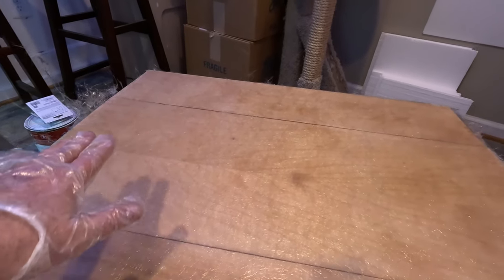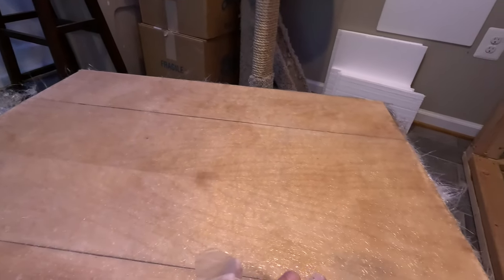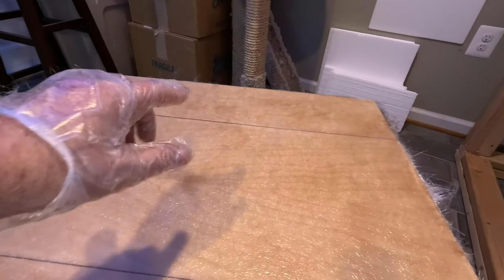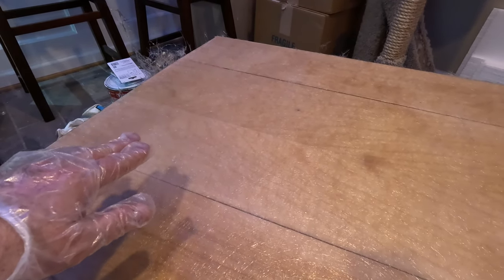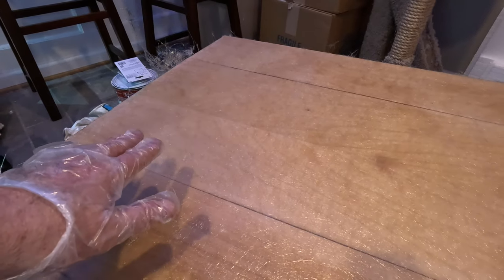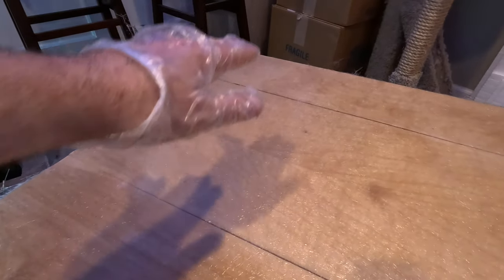The other thing is when the mat was on here, I did a pour. I poured out about 28 ounces of resin mixed with hardener, and then I used the roller. Basically what you're doing is just saturating the mat material with the liquid. You can't push down hard to move it. You'll just tear the fiberglass mat. So you've got to have pretty good coverage with your pours, and you're just spreading it out. You can't push it out.